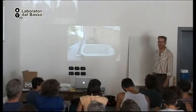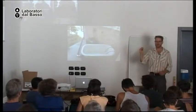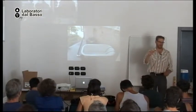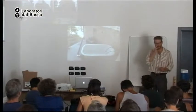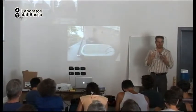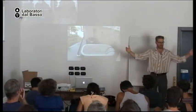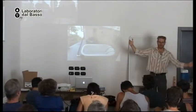Okay. The next level in complexity has a pipe from the bathtub to the citrus tree, the orange tree, or the lemon tree. And you keep a continuous 2% drop in the pipe. It's always moving downhill. This is very important. Okay? So at minimum, it must drop 2 centimeters for every meter. Okay? It can be steeper, but